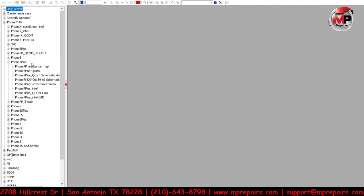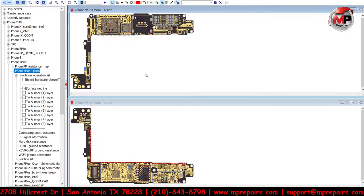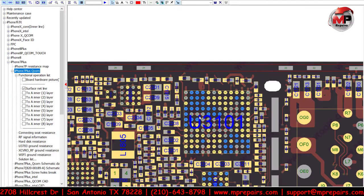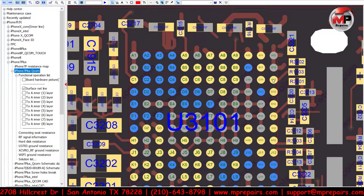iPhone 7 Plus. So we're going to go down here. So normally, that's why I had confused it last time. Okay, so, no, I'm not trying to go to the schematic. Okay, so that's the main break, audio codec. So that's where our problem is. So it is the third one. The other two are grounds. And usually there are more further down at the bottom that I've seen that sometimes get loose. But this one seems kind of solid in there, which is kind of a surprise.